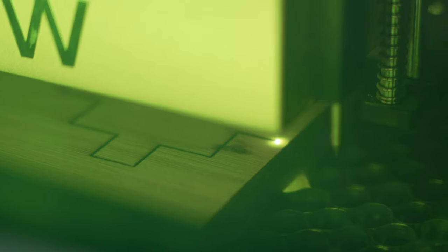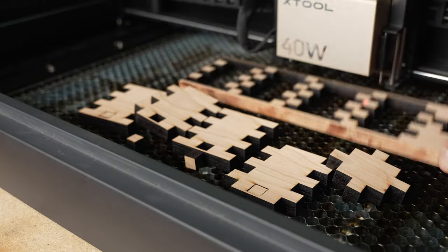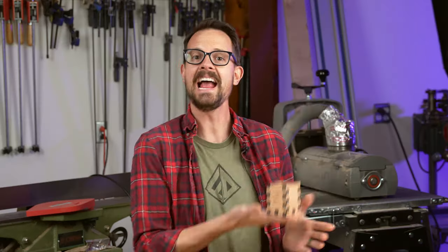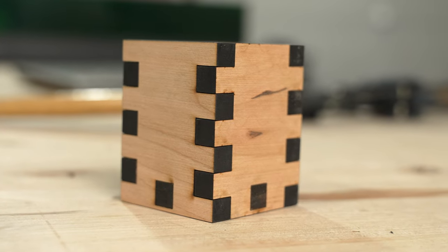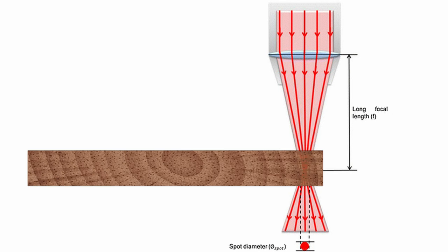With this info, I'm going to cut a quick box joint box to see if 4 millimeters per second is reliable. And voila — box joint box. A normal laser project for 12 millimeter thick cherry. Easy peasy. One note: I was cutting with the laser focus 6 millimeters down into the wood. The laser makes an hourglass shape, so by focusing in the center of the workpiece, I should minimize any gaps. You can see this shape if I hold up a laser cut edge next to a square.